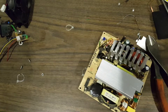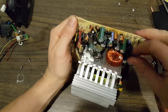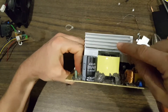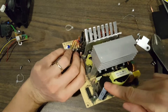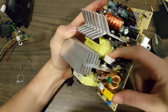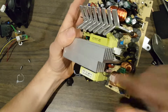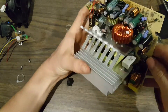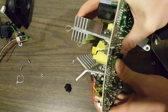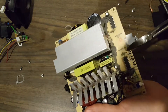Here's all of our wires — we don't need those. There's a lot of silastic in here; everything's glued together. A couple of decent heat sinks — those would be handy. And there's a small transformer, there's our large capacitor, some pretty good toroidal inductors, a small inductor, something that looks like a power resistor, some protection circuitry, some MOVs. This is probably a thermistor of some sort. I would rather not have to do any more desoldering than I have to. So can we just break this apart? I'm really not concerned about some of the smaller pieces.